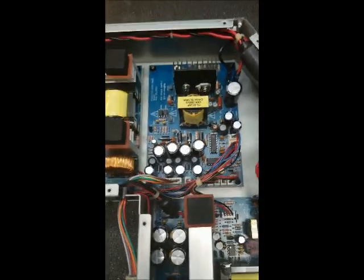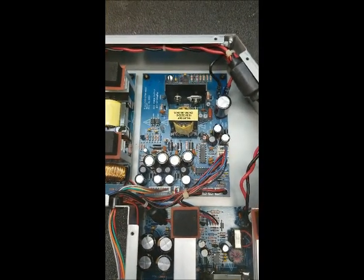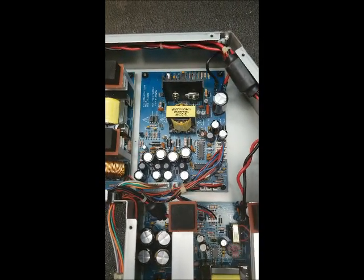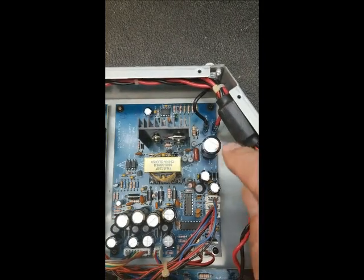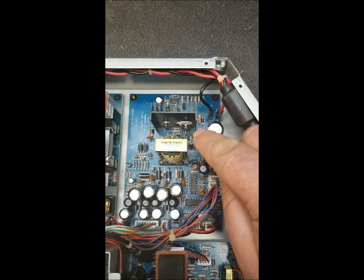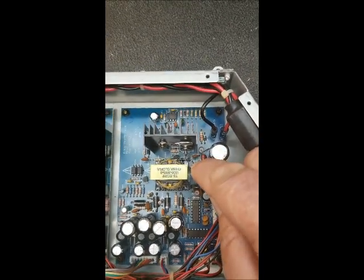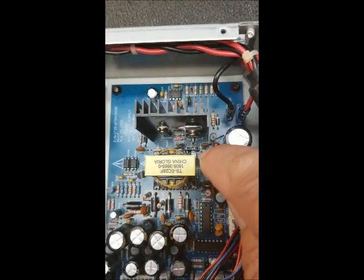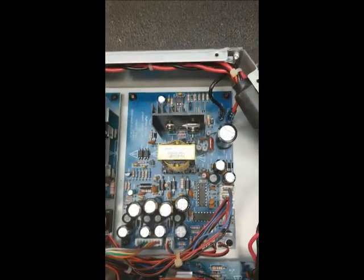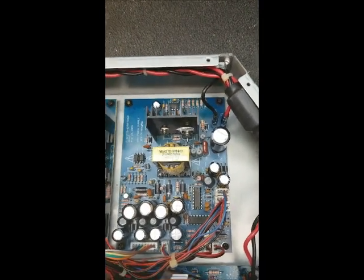In this particular case there was one diode — it was the negative 15 volt supply diode, D607, dead shorted. And apparently when that happened — I'm not sure, cause and effect could be either way I suppose — back here on the chopper side, the FET is a 2SK2645. That opened up, and if you look way down in there you'll see this little snubber diode that goes across the FET. That little snubber was very, very leaky. It's a UF4006 — D60-something or other. But in this particular case, that's what the problem was.